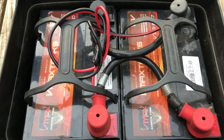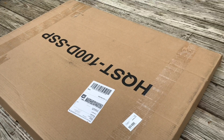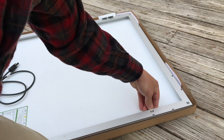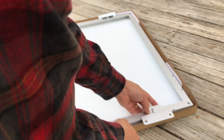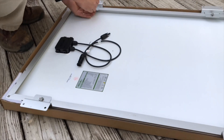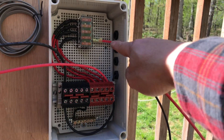This battery bank is actually for my trolling motor, and I'll be using it today. I'll be putting up my solar panel and getting them all connected. Let's pop this thing open. Negative battery goes right here. Positive with the breaker — positive. The red one is now fused at 10 amps.